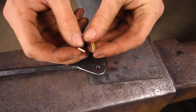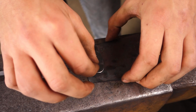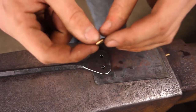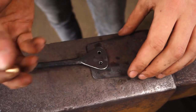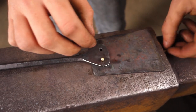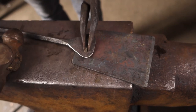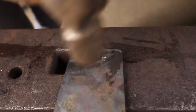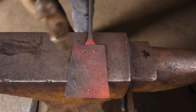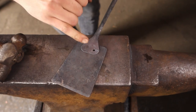I have these two rivets — just little brass rods. Really a copper or brass rivet would be better, but I'll use these to fix the two pieces together. I've found that brass doesn't rivet cold very well — it crumbles and cracks — whereas hot it does it fine. So I'll heat it up, put it in, rivet one on, heat the next one up, put that in, and do them together. Job's a good one. I'll heat the next one up and put it through that hole.